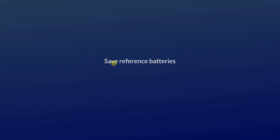I wish that I had saved some reference batteries when I deployed this sensor in the beginning. That way I could compare what natural self-discharge has meant compared to the device being powered and used. I started using some no-brand batteries, and they died due to freezing temperatures the first night, so buy some proper quality batteries. Document your project. If that means writing something down in a book or writing a guide that you publish and share with others, it is really helpful to be able to go back and look at the decisions you made and why you made them. An oscilloscope with serial decode capability is really useful. More and more sensors are digital, and they communicate over a bus type or the other, and being able to read them raw without going through a microcontroller is really useful.